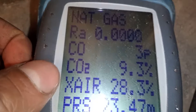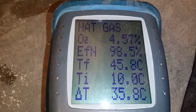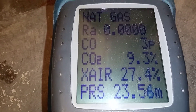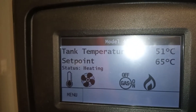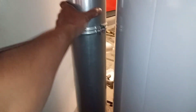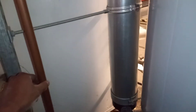Here are my combustion readings. Ensure that you check your flue, your air, your gas, your safety devices, and ensure that things are clipped properly — that there's not too much movement. Check your gas supply is clipped. I'm going to recommend that this gas pipe gets clipped; I don't see much clipping on it, so I'll flag that up.